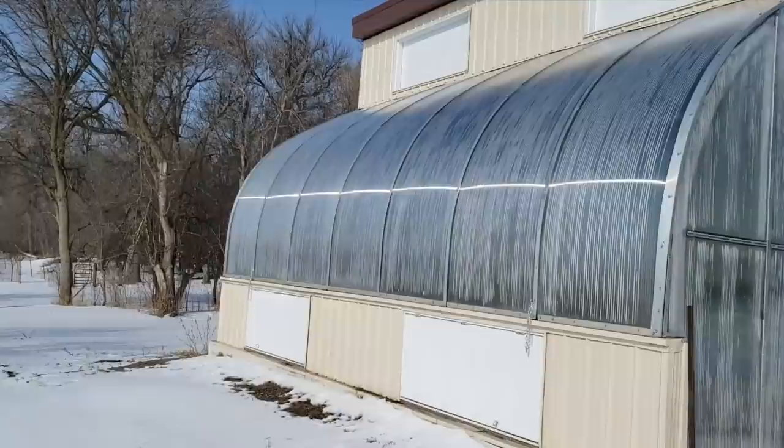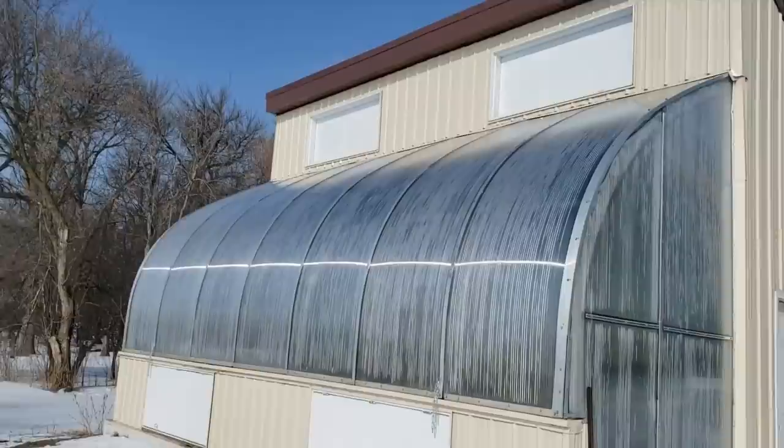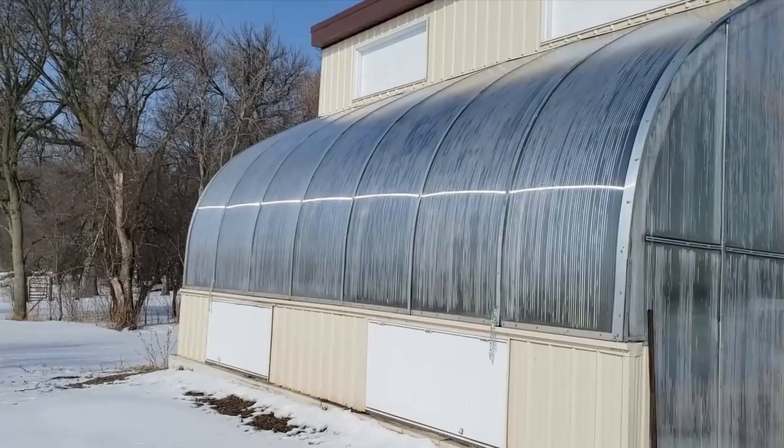The guidelines that they give you is when you cut it, on the top you can get this aluminum tape that you put across the top so that nothing gets in there. And then on the bottom, you need to have a mesh tape, so that water can evaporate or run out the bottom when it condenses.